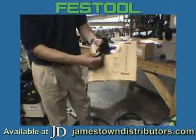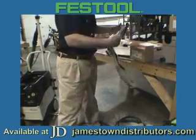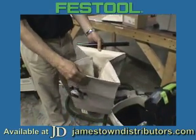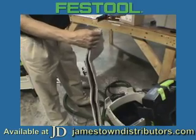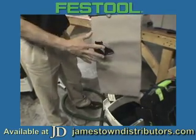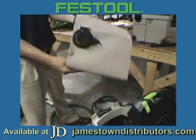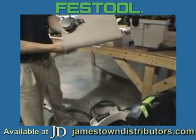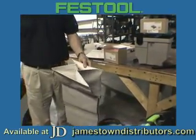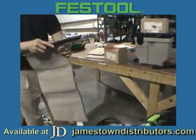When the paper bag is full, it caps up and you can discard it. The long-life bag has a zipper on top — it's a double-lined bag. It's not recommended for toxic or mixed particles. If all you were doing was sawdust or chips, it's perfect. But if you start mixing glues and resins, they could eat through the inside of the bag — and it's too expensive to waste. More importantly, when you fill a bag with toxic material and open it to dump it, it becomes airborne. With the paper bag, it's all closed and sealed, then you throw it away. That's safer and more environmentally friendly.